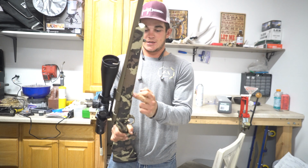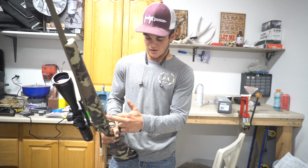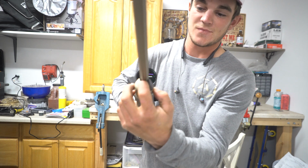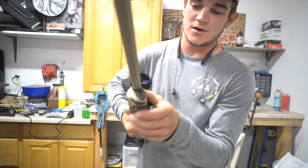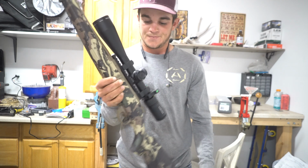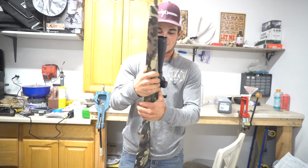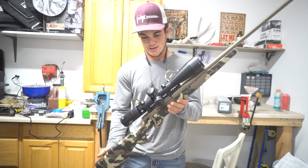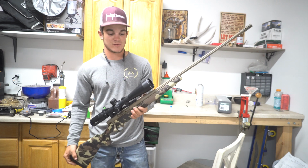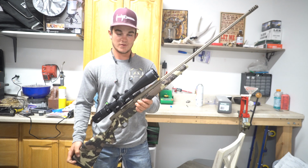We bedded the action into the stock. We bedded the bottom metal of the action in the stock. We took a little bit of that stock away right there so the barrel is not contacting the stock. We got good clearance from the barrel to the stock. Overall, I think this gun's going to do pretty good. We'll see how the first couple shots go through it, and the next videos will be on load development of this gun. So that's kind of how you put a factory rifle together to shoot long range.